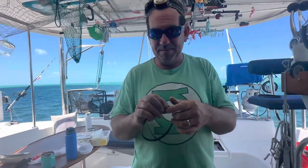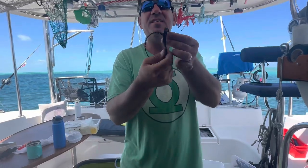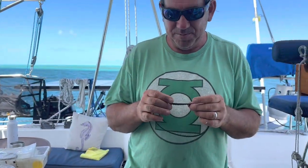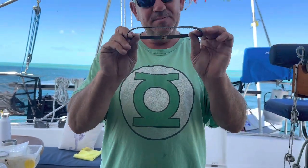What happened yesterday is this: it's a geared, flexible rubber belt — made by Gates, which is pretty cool, because Gates has been in belts for a long time. The belt just got old and some of the teeth came off. So in our spares — hopefully the others aren't as old. Yeah, they seem more pliable. I've got a part number to order more. I'm just going to slip this over and we'll be good to go, making water again.